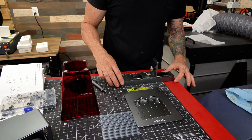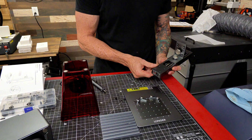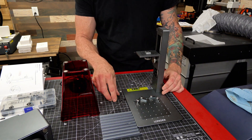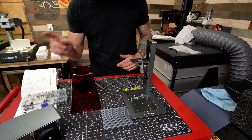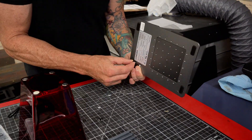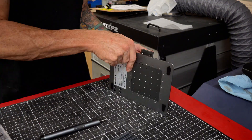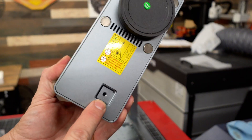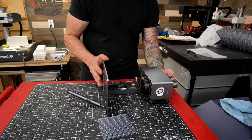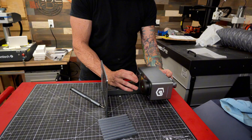The assembly of this Nano 12 is very simple. You're going to have four holes in the base and they've machined a small pocket out. Simply take the column and mount it inside of that machine pocket, and then using the correct screws outlined in that detailed manual, mount this column to the base. Next you'll notice the indentation with a threaded hole and a large nipple over here on this riser base. Lay it on its side to ensure you do not get this piece cross-threaded.